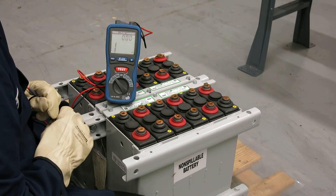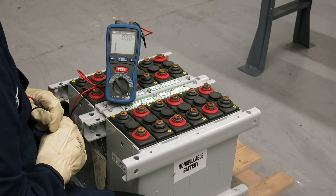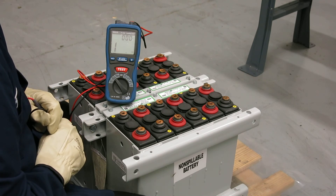If we find an insulation resistance less than one megaohm, then we're going to have to investigate and see if there is in fact a leak within the module, which may mean disassembling the module.